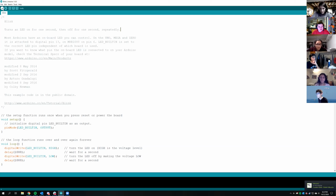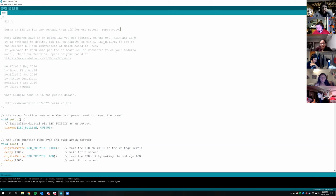There's a little arrow that says upload. If you click that, it should compile the program. So it's making sure that all of this works right, and then it uploads it onto the board. Then the board should just start immediately running, and your LED should be blinking.